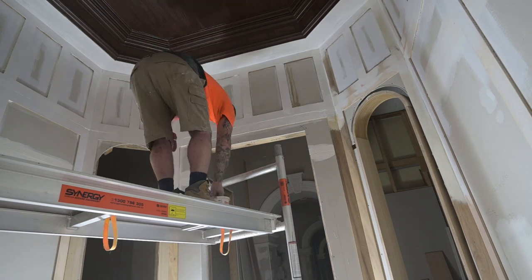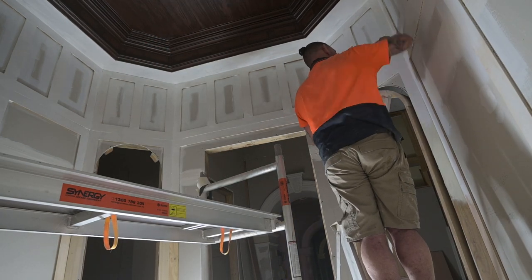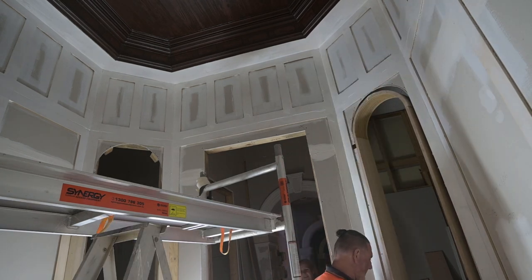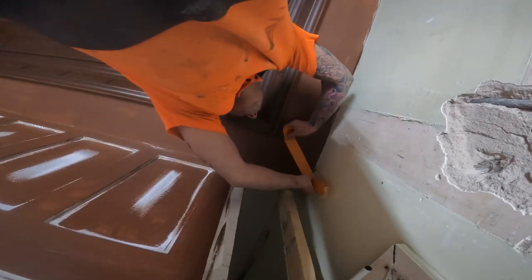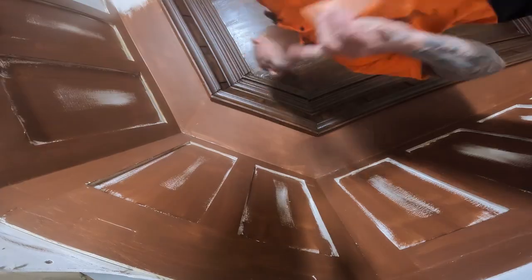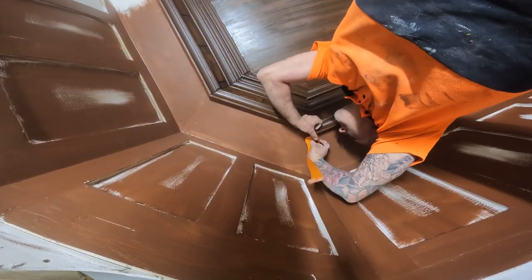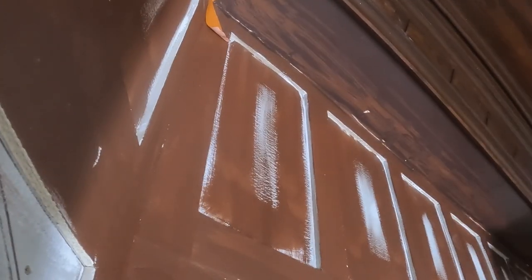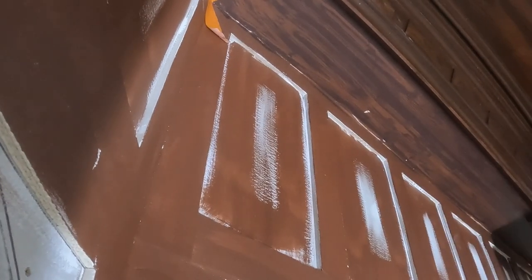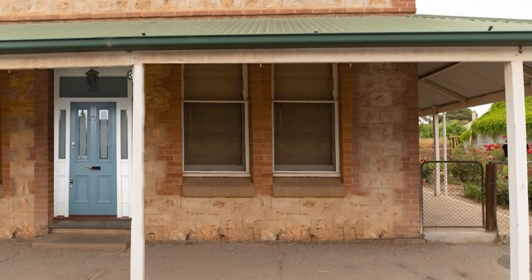I came along and undercoated with my white undercoat, just going around the edges because that's the only bit you're going to see once the rest of the paneling — the panel in the middle and the molding — goes on. Doing a little bit more wood graining here, masking off my joint so I can get a nice crisp joint in the pieces up there and running my wood grain tool along. There's a little bit of paint peel off but I can easily add that back in before I put my toner on.